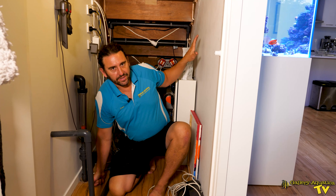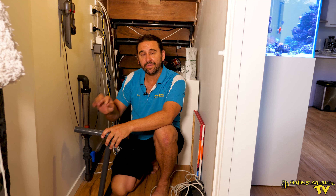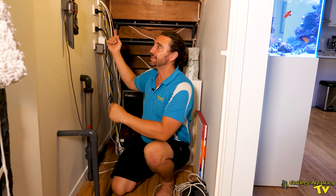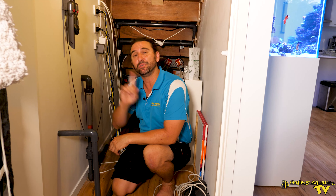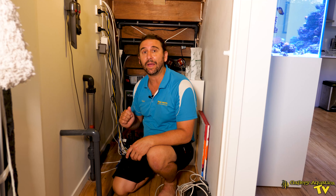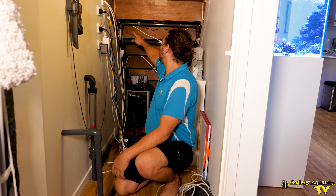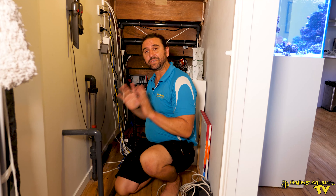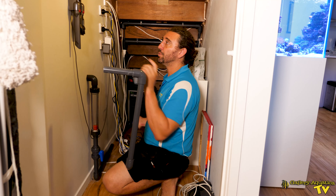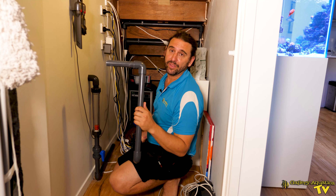The tank is on this side, so we have to have our 25mm or 1-inch PVC come through the wall on this side and go around underneath the stairs over to this area and through to the UV sterilizer — there's quite a bit of plumbing to do and we also have to have the return go back the other way. Our plumbing is going to go all the way to the back; we've started cutting some of the pieces and placing them, and we've drilled the first two holes through this wall — we're yet to drill the holes on the other side.